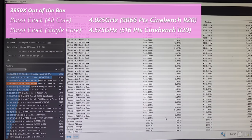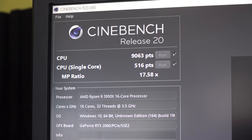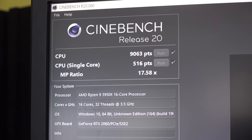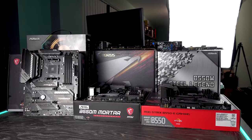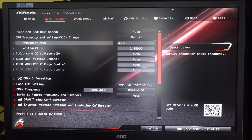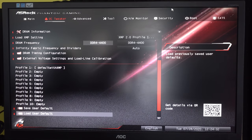Out of the box, it's going to boost the 3950X to 4.025 gigahertz on all 16 cores, 32 threads. This enables us to get over 9,000 points in Cinebench. Single core we're getting 516, which is a little higher than I'm used to seeing. The all-core speeds are beautiful on this board, going higher than any of the B550s in my other comparison. It also runs 4,400 megahertz memory absolutely fine on XMP using the Aorus memory modules.